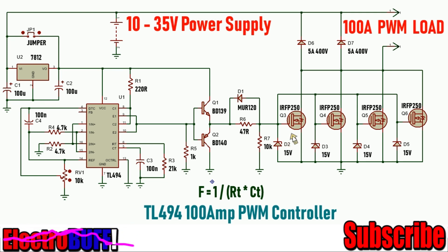The D7 and D6 diodes ensure that in case you connect an inductive load, the MOSFETs will not be damaged due to inductive spiking. Additional zener diodes are included across the gates and sources of all the MOSFETs. This will ensure that in case you do not use a regulator and the voltages at the gates of the MOSFETs are beyond 15 volts, they will safeguard the MOSFETs from damage.